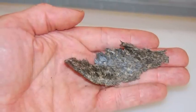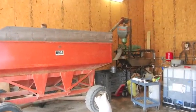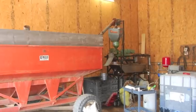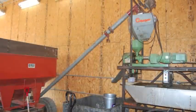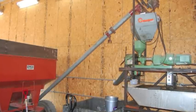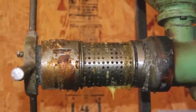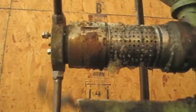He has it set up with paddle switches on a small hopper above the oilseed press, runs it out of a grain bin or grain trailer, keeps the hopper full, turns it on, and leaves it. It doesn't take any babysitting. He's got a filter press now and filters the oil so it's cleaner. He doesn't change his fuel filters nearly as often and has increased the amount of vegetable oil mixed with petroleum diesel.